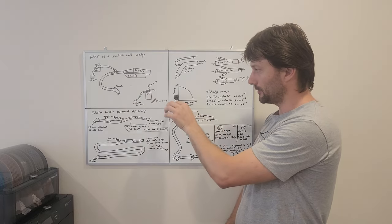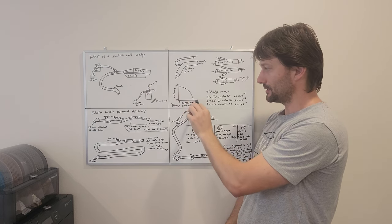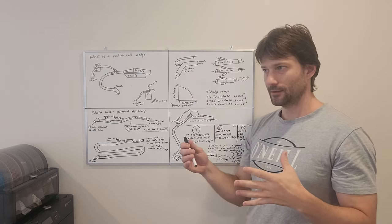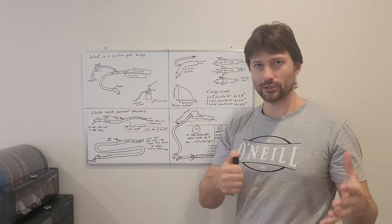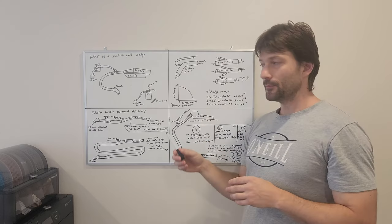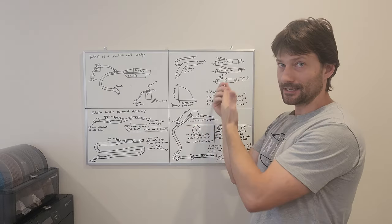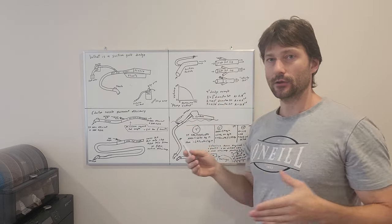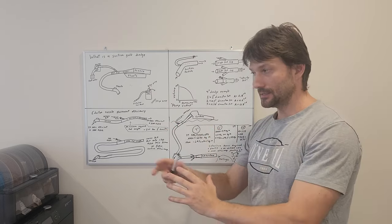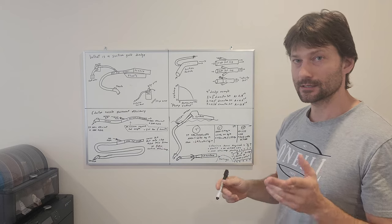The pressure you're putting at your pump follows a pump curve: as the volume comes down, the pressure goes up, and as the pressure comes down, the volume goes up. So wherever you are underneath that pump curve is the mix of pressure and flow your pump is putting out. To compare apples to apples of how efficient a single jet versus a double jet is, the double jet would need to be two smaller jet logs. With a 3D printer, I can have a bunch of different examples and compare the efficiency of one versus the other.